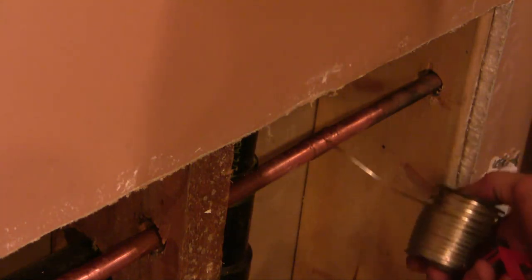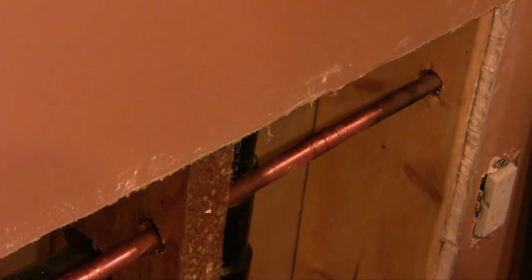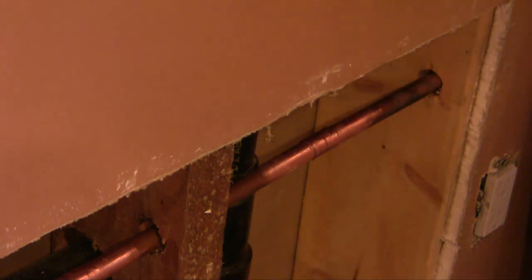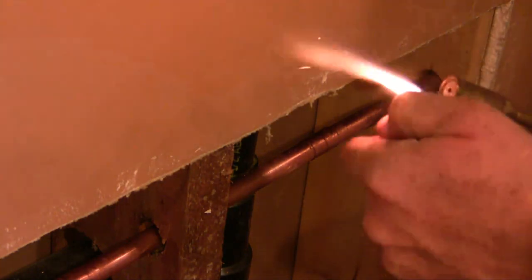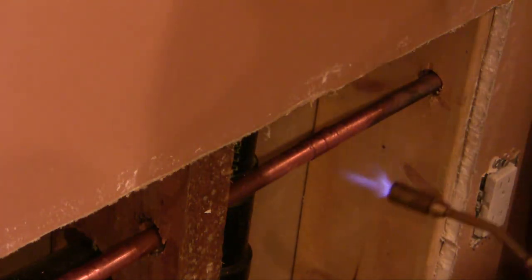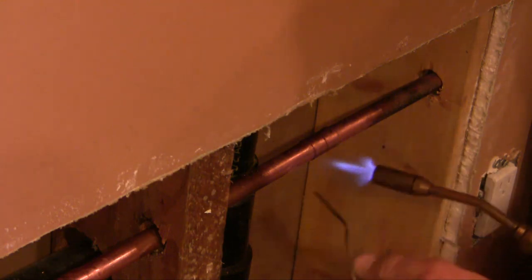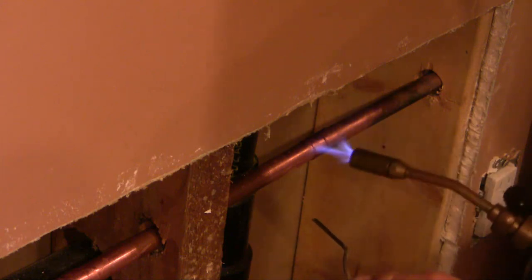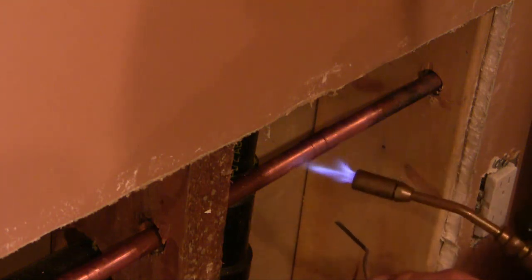The solder paste allows the silver solder to wick into the joint and create a nice clean joint. We're going to heat it up with this propane torch and then solder the joint. Very important: you use lead-free solder in this situation — certainly never use lead in a situation where the water might be used for drinking. You heat the pipe up; copper conducts heat really well. Of course, the water is off and there are no drips of water in there.